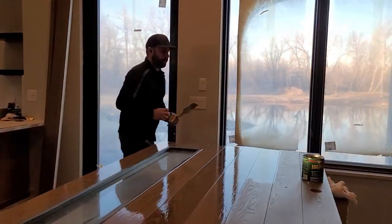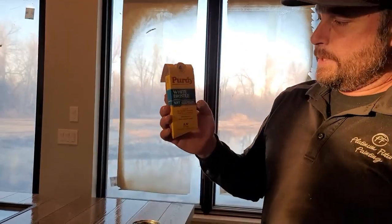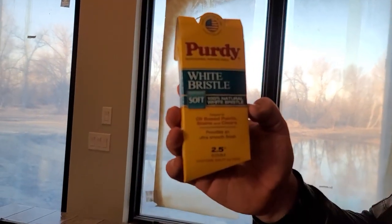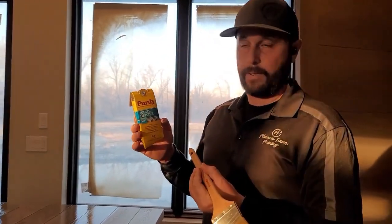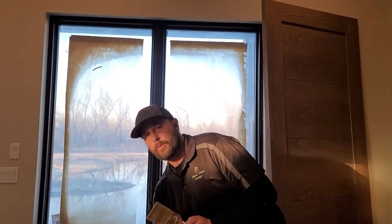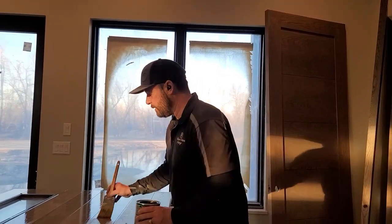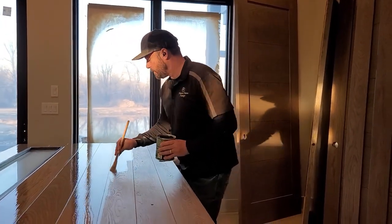For clear coats, if I'm doing like a brushing lacquer or brushing varnish, I'm using a white bristle soft brush. Now this is for oil-based paints, stains, and clears. I actually really like these brushes. I'm not sponsored by Purdy or anything. I just like this. We kind of call it like a white bristle or a China bristle brush. It's a little bit more coarse than normal brushes, almost like the old horsehair brushes, but it does lay out very smooth, and it really has enough pressure and power to push it down into the wood grain.